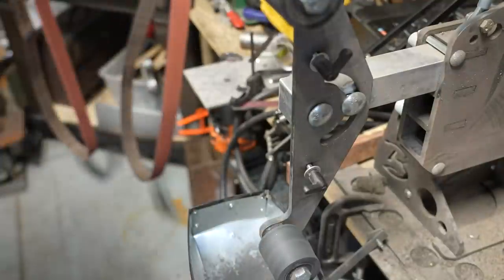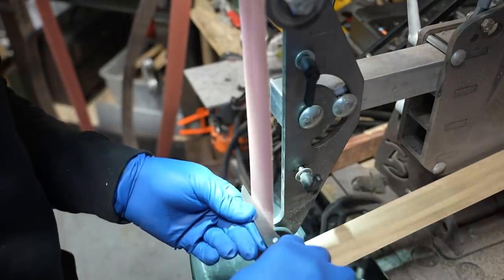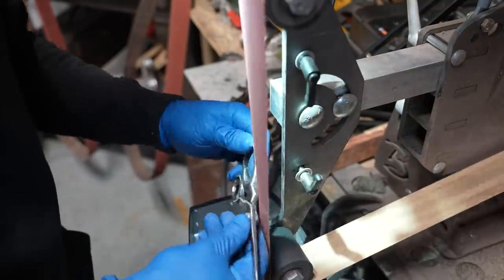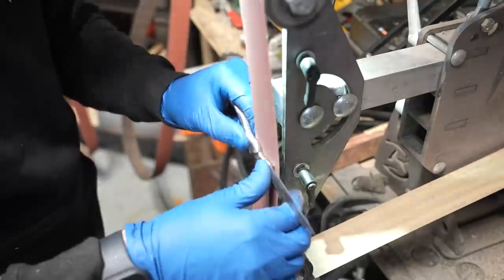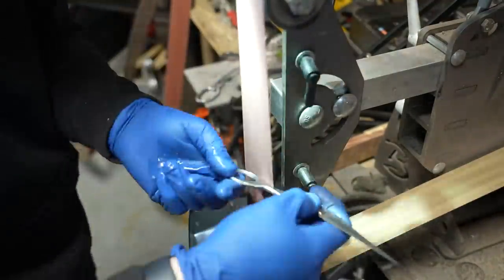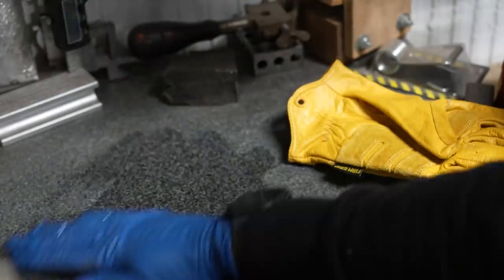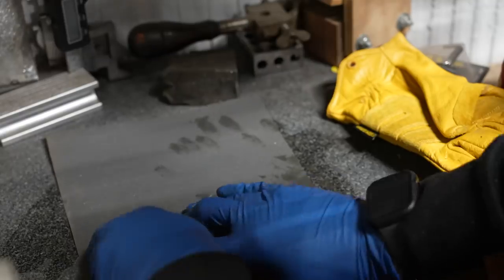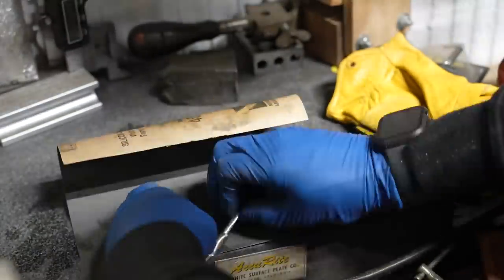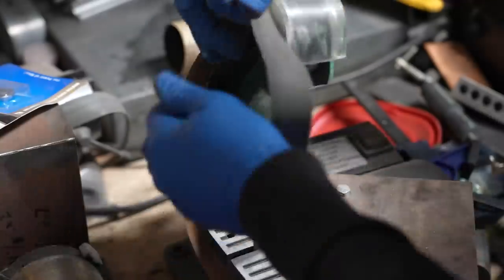At this point I can do a little bit of finishing and fixing, and I double check the fit as I'm going. I take off the grinding belt and put on a 220 grit belt, and I take off my platen so I can use it as a slack belt and really contour in those edges — this is what's going to give it that more natural feel and soften up anything left over from the flap wheel. I want these things to be nice and soft and organic on the handle so they're comfortable to use. Then I went over to a granite surface plate and, just using a piece of 400 grit sandpaper, ground in those flats on the shear side so that when I put the things together they wouldn't bind up or grind — I wanted to make that pretty polished so it would work out well.